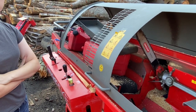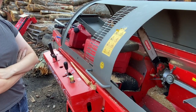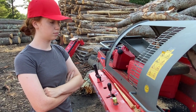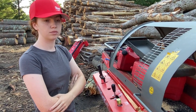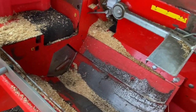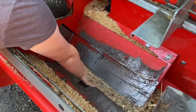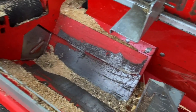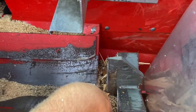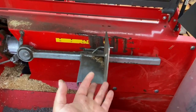The outfeed conveyor may still be running when you lift that up, but you can't get to it anyway. You've seen stuff explode on the big splitter — which splitter is safer to operate? This one, because when they explode they usually go sideways and you're all the way back here. It would go through here. It's a big V, so when it goes up against this wedge it tries to blow out, it's going to hit these sides — the wood can't come up out of there, plus you've got this in the way.